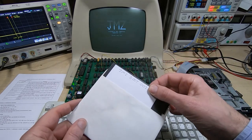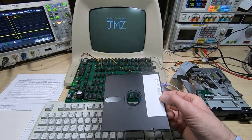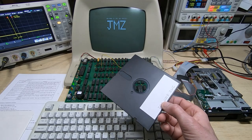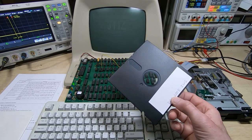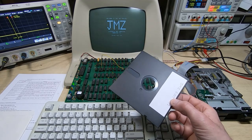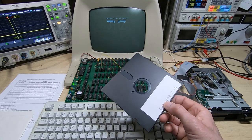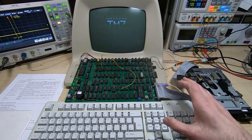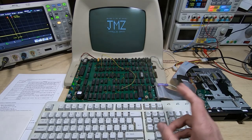I've got the same boot disk I had previously. It contains a very simple second stage bootloader. The sequence is: the bootloader in the monitor ROM will try to load the contents of the first sector of the disk, then hand control to that code. In this case it contains the second stage bootloader, which switches to bank zero so we have the full range of RAM, then tries to load the next two sectors of data, which is just the Game of Life. There are many things that can stop this working, so don't get too optimistic - there's a lot that has to be in place for a floppy disk to be successfully read.